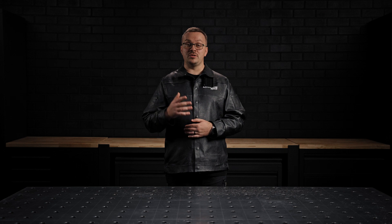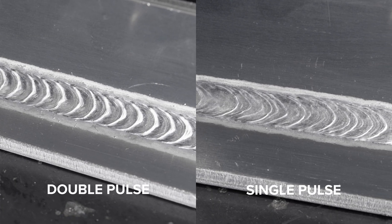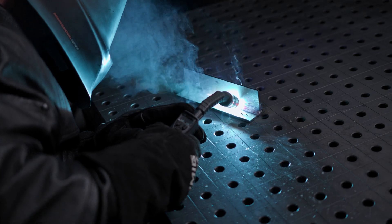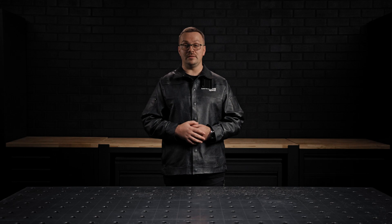The Evolve Multi 500 Pulse supports both single and double pulse MIG welding, offering exceptional precision while significantly reducing spatter. Pulse MIG operates via pulse transfer, where the welding current alternates between a peak current for droplet transfer and a background current to maintain the arc. This process minimizes heat input while delivering excellent penetration, making it especially suitable for materials like aluminium and other heat-sensitive metals.